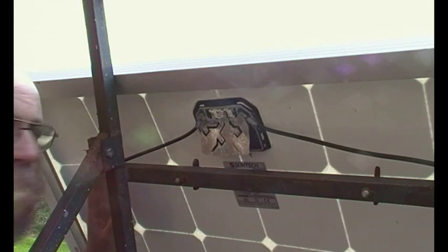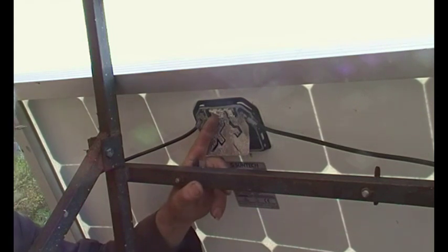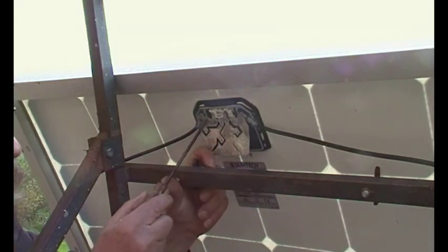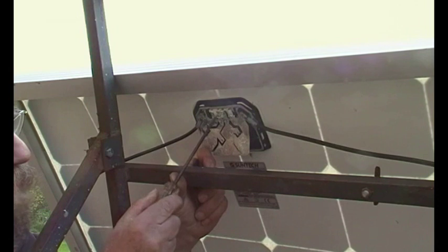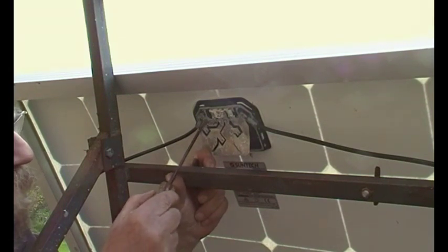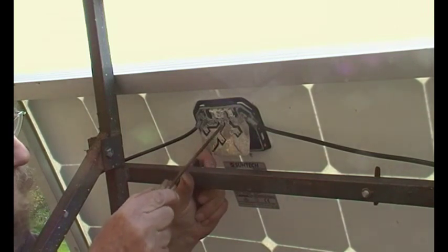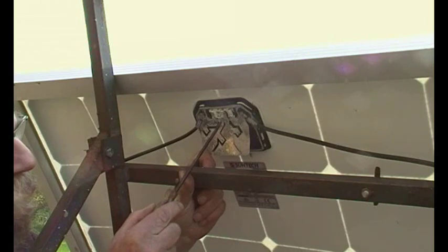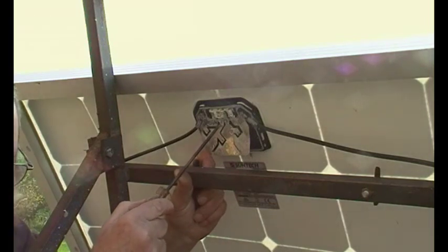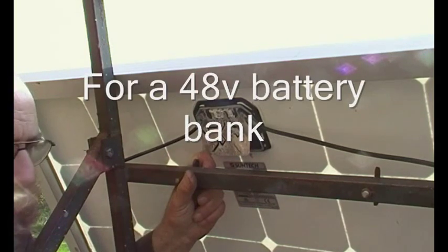That one — there's something wrong. So what we can do is start taking power from here. So that is connected to there, and between there and there there's not sufficient current. So what we need to do is take this cable and attach it to this bit of heat sink. Then there's a diode there, through there, diode there, and out. This is a nominal maximum power point 30 volt panel, so this will become a 20 volt panel. So we would need three of these.